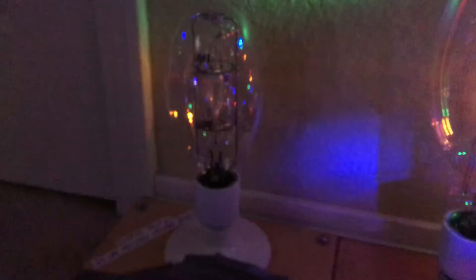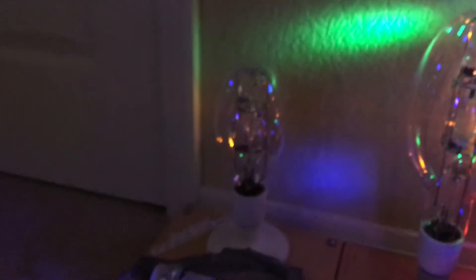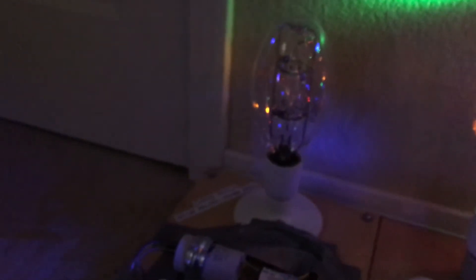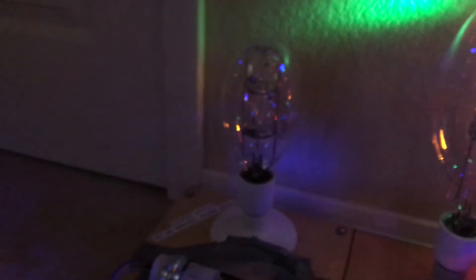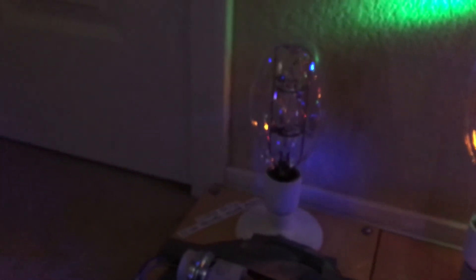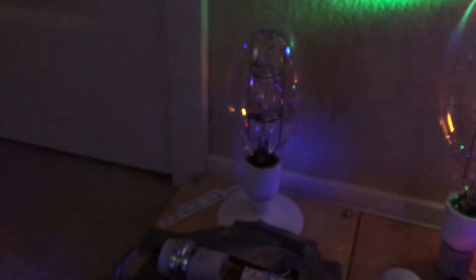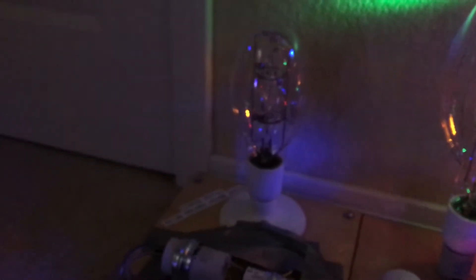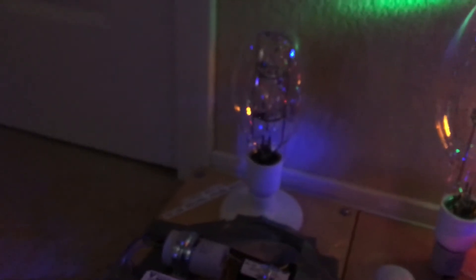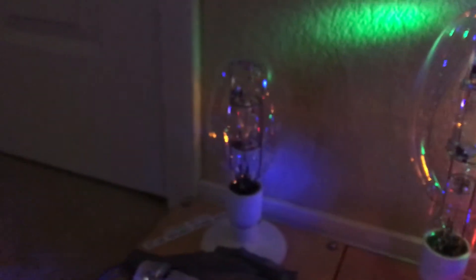The second way to tell is also quite simple: just by turning on the lamp. The lamp I'm going to be turning on for the second method is my Venture 200 Watt Vertical Operating Position Pulse Start Protected Metal Halide Bulb. If you see that the shield is glowing a very nice bright blue aqua color when it starts up and at full brightness, that tells you that the shield is UV filtered. I'm going to go ahead and turn it on and see if it's UV shielded or not.